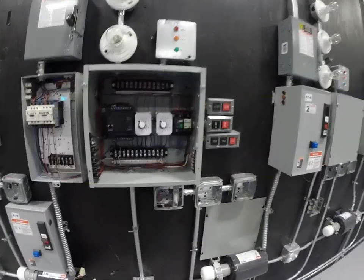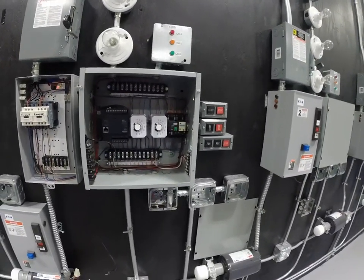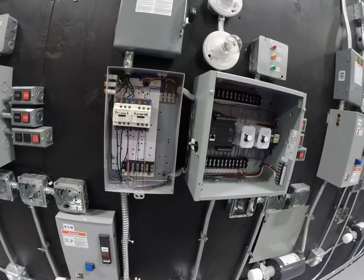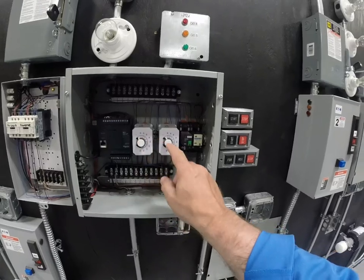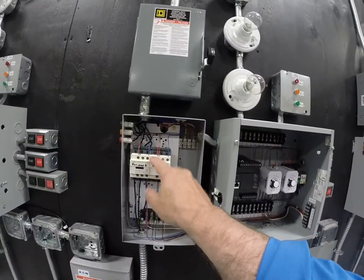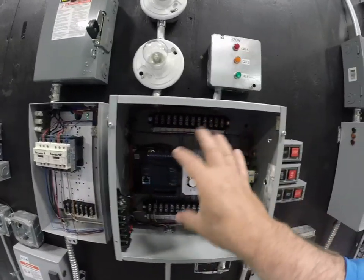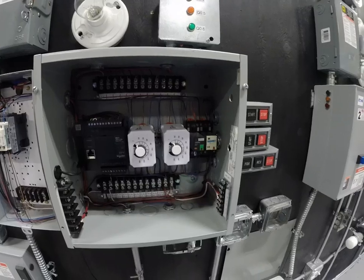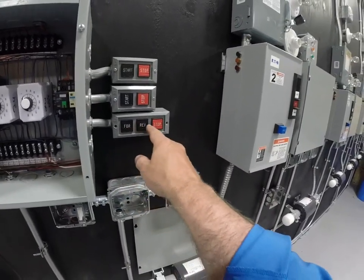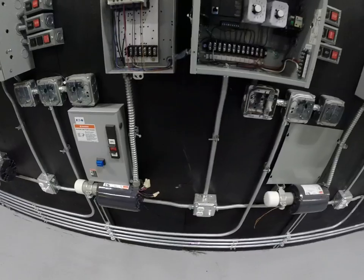In here we've got some wiring that a student named Jose prepared. He did a pretty good job wiring this controller. Basically, it's a forward-reverse circuit, which allows the motor to go forward and reverse with certain safety parameters using timers and other relays. You can see wiring going between the motor starter contactor and indicator lights, incorporating forward and reverse buttons with a forward and reverse contactor to let the motor go either direction without harming it.